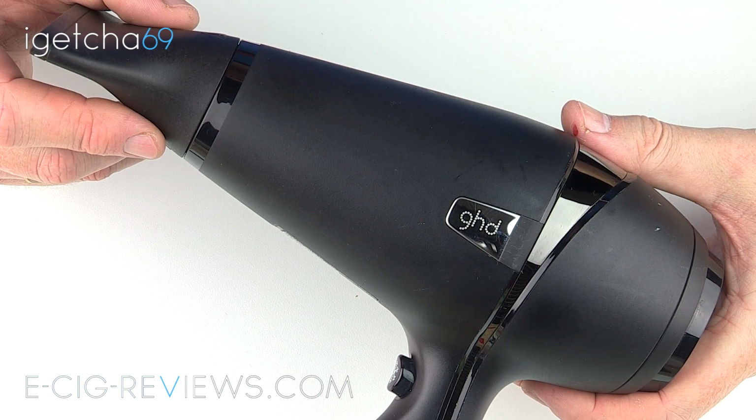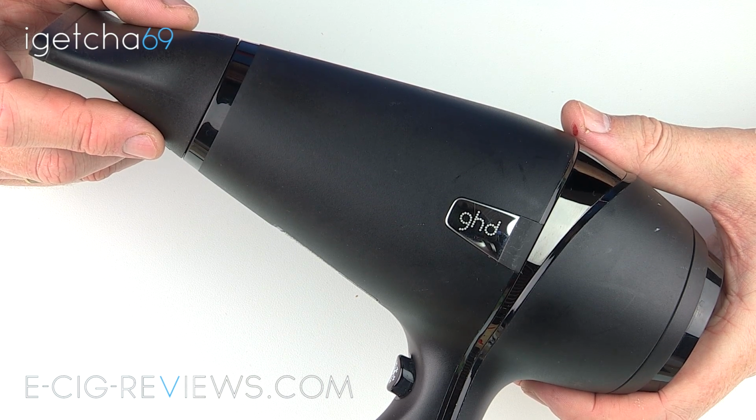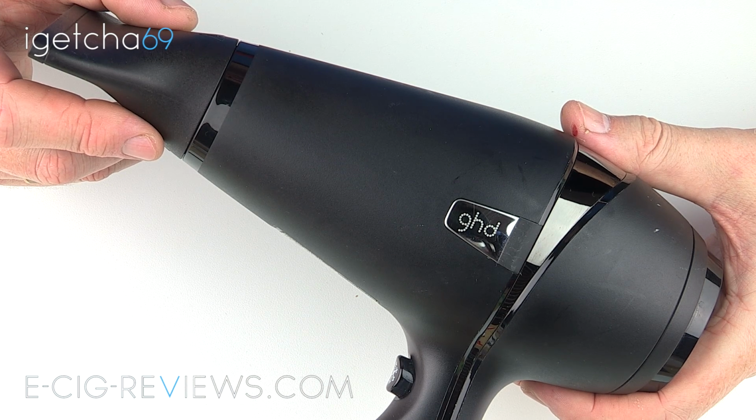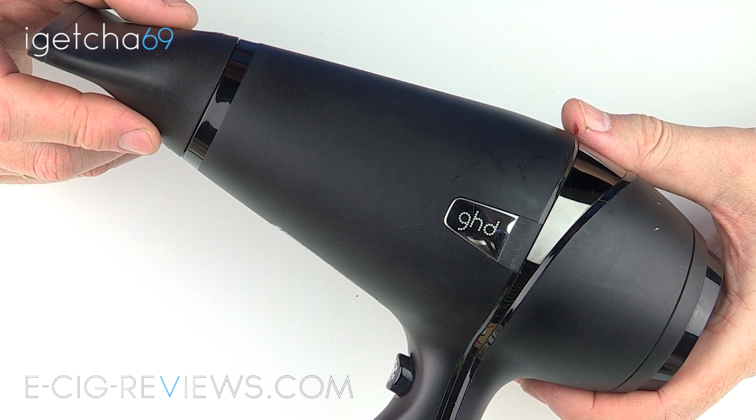Now, the battery wraps are basically heat shrink, so as you apply heat to the battery wrap, it will then shrink and form itself around the battery. Now, I have seen people using things like a lighter and a chef's blowtorch, but personally, flames around batteries is not my cup of tea, and I prefer to use something like my wife's hairdryer.